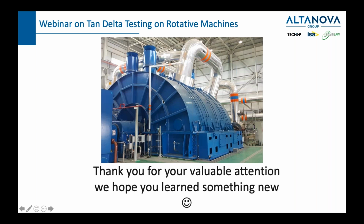Okay, Mr. Nuno Santos: if we can't open the star, can we detect a problem between phases? No, because there is no way to measure if all three phases are on the same potential. You would have to separate the potential in order to see which phase is leaking towards which phase or towards which ground. So that's a must.